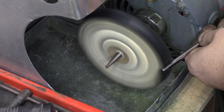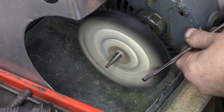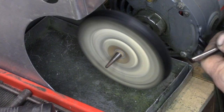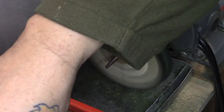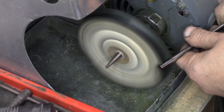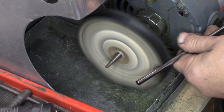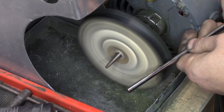That's a five-inch spiral-sewn chamois wheel. As I'm doing a side-clamping conversion on Sophie, this is the replacement presser bar I'm going to be using. I went through my stock of presser bars and needle bars until I found one that fits — I checked it on her and it'll be just fine. I'm not 100% sure what machine this came out of; it might not even have been a Singer. All I know is it's a good length and will work. Now I'm flipping around to do the other side — I use yellow compound on this wheel.